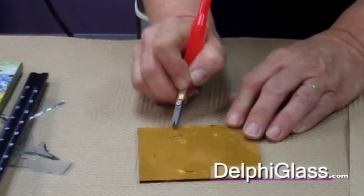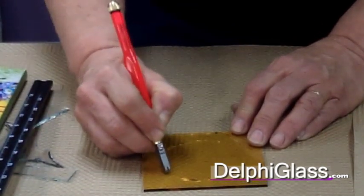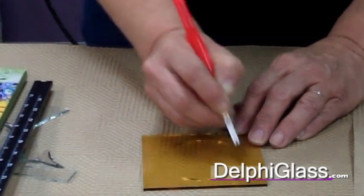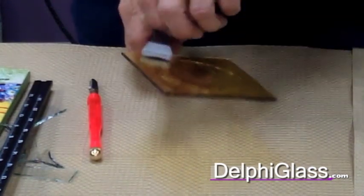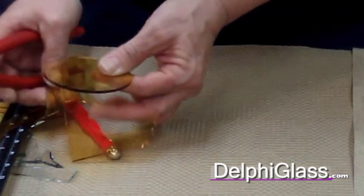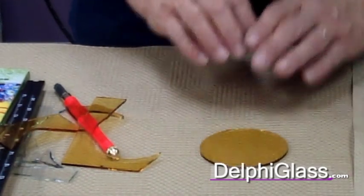And cut the rest of this off with a watch band effect, so it'll look like a watch band when you get done. Then you're just going to catch the edges. Take your running pliers and just break off — sometimes they just fall off like that. And then there's a nice perfect circle. You don't have to grind it, and it looks good.